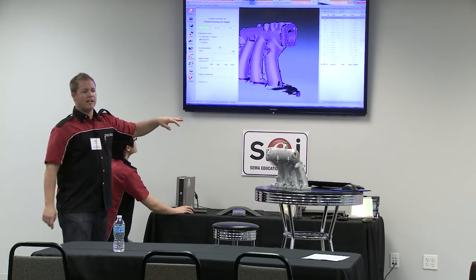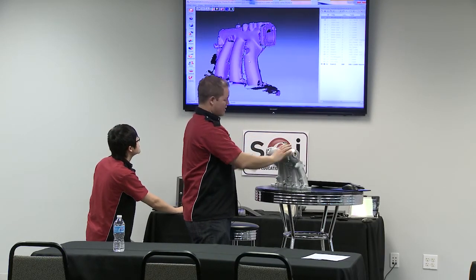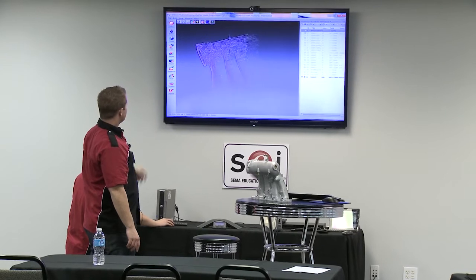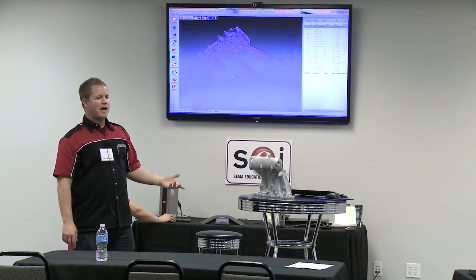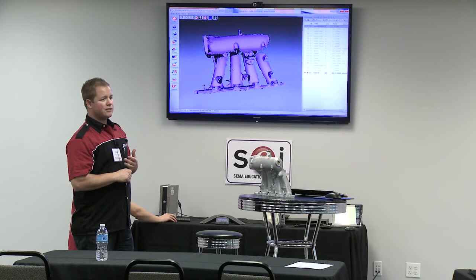This is still just a point cloud. Whereas if you were taking CMM points it would take a long time to get this many. You can see all the points as it's rotating — this is just a quick shade. Within the software you can take this point cloud into a mesh so you can rapid prototype it, or take it into third-party software to start doing surfacing.